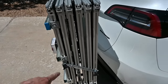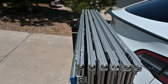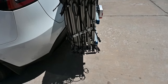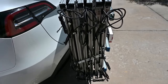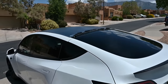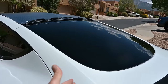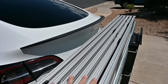There are also a few additional steel crossbars that I added to help improve the folding. For the electrical connections, everything is in series — all these panels are in series. Each one of these bundles is an MC4 connection. There are another two panels that are in parallel with one another, producing 10 amps and around 20 volts, and those come down through the rain channel into the trunk.